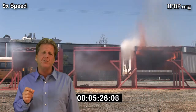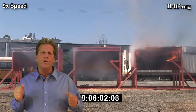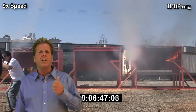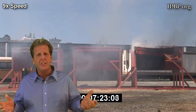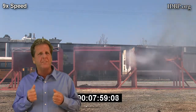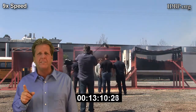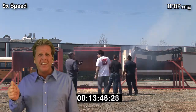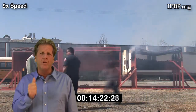The red shield I-joists and the open joists — basically the ignition burned down, but we never got acceleration in the floor system itself. The coating basically repelled the flames, so you never got ignition in the sheeting or the floor joists themselves. There are no tricks here — they all had the same ignition, but we accelerated fast on the raw product because of the glues and resins that hold them together.